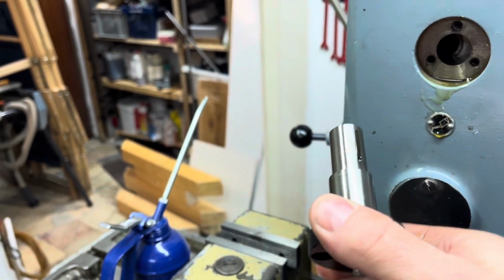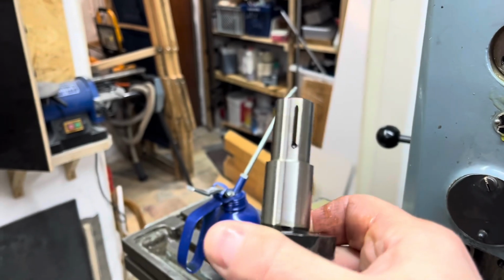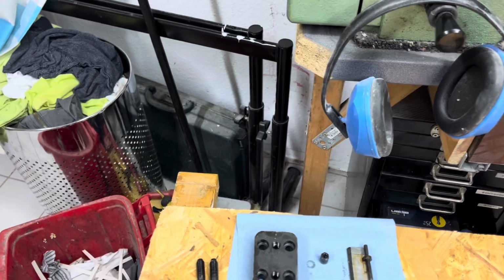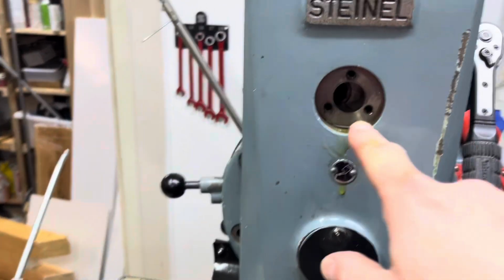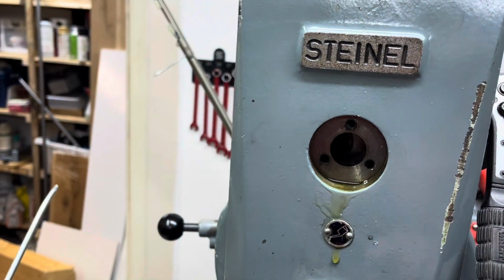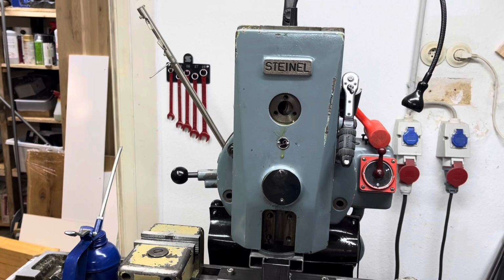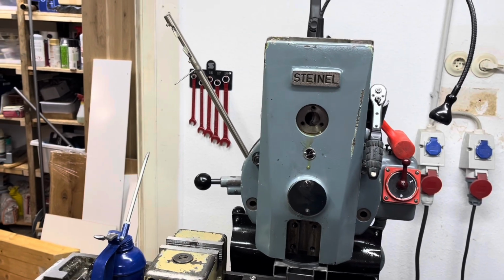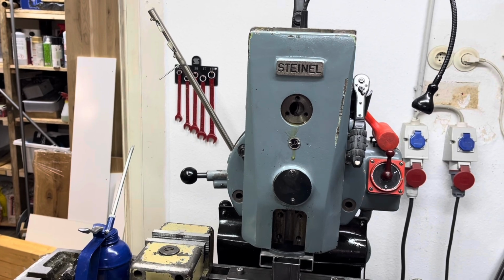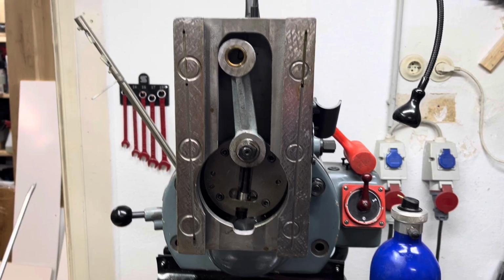and you see here the oil channel. That thing I pulled already once and cleaned it, so the oil channel is now free. With that thing pulled out, you can see in there where it used to engage with the up and down mechanism. And now I'm trying to move the ram up very carefully and put it aside and have a look inside. So that went smooth.